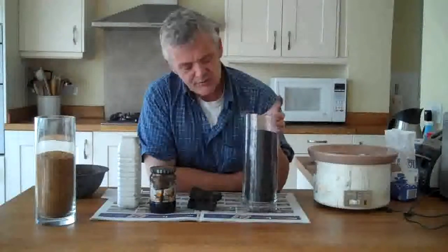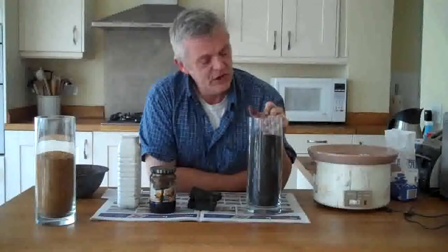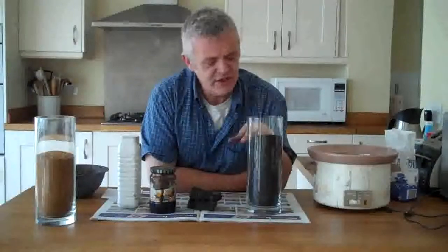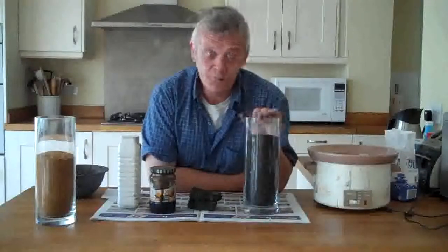In an earlier video I demonstrated this set up as a water filtration unit with a Coca-Cola demonstration. That's the second method of making graphene-coated sand — a little more complicated than the sugar method but much cheaper because the heating time is so much lower: 3 hours at 400 degrees instead of 7 hours at 750 degrees. In terms of heating energy, it's very much cheaper to make it this way than the sugar method. I hope that helped — thank you for watching.